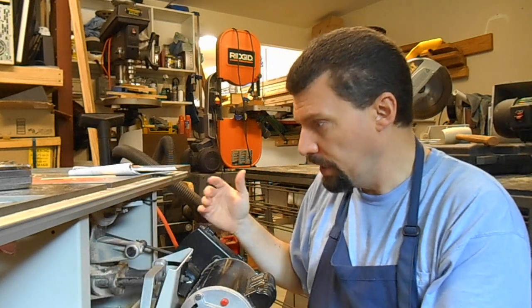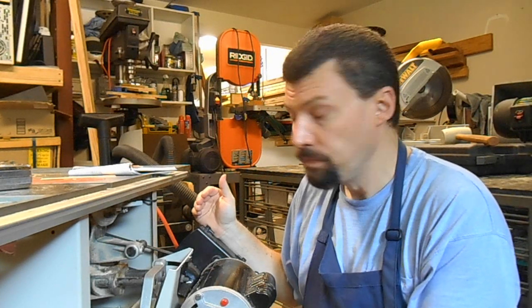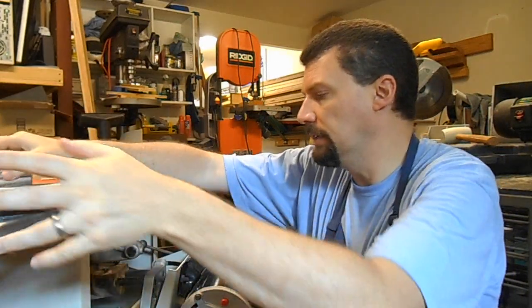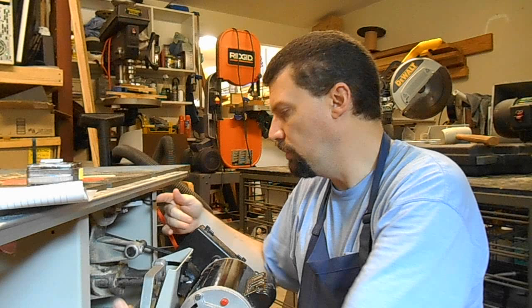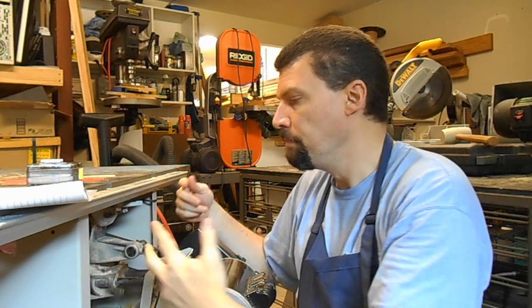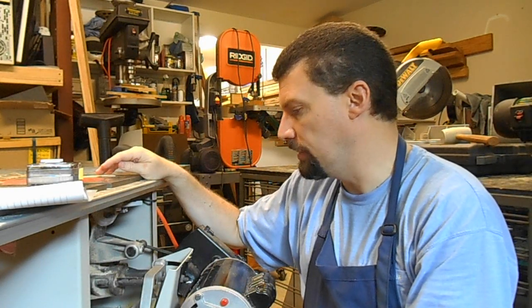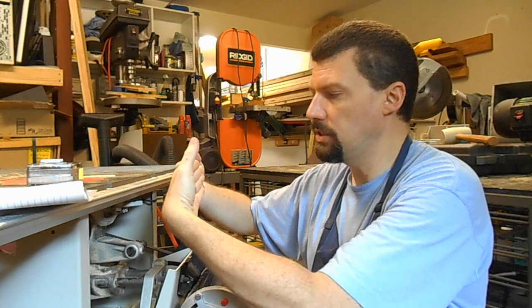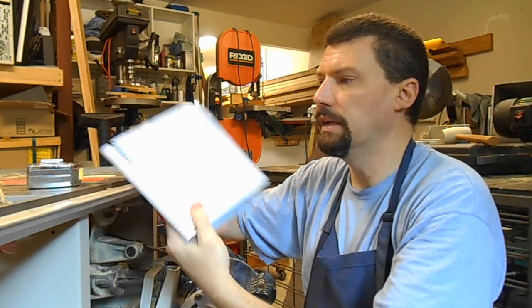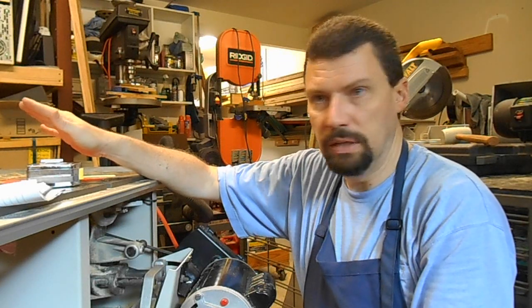With this huge opening, it's kind of no wonder. I've made a few small modifications to the table saw already and I'll start by showing you those. I'm taking measurements off the back of the saw and working out a way to make a couple of baffles that will sit in here. Two of them are going to be fixed — one to either side of the box — and a third one is going to be attached to the tilting arbor motor mount assembly. And since they don't sit in the same plane, the one attached to the arbor mount assembly will sit behind it, so it can move like this and stay out of the way. That's what I'm working on right now — making some sketches.